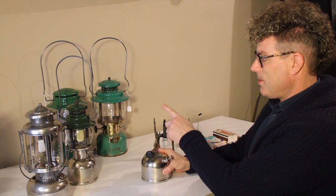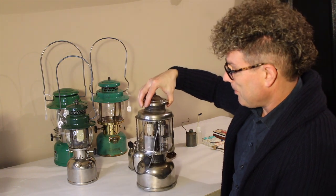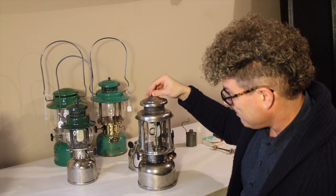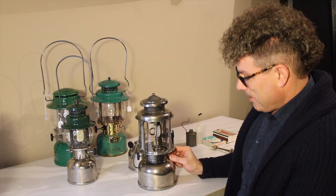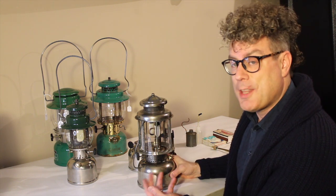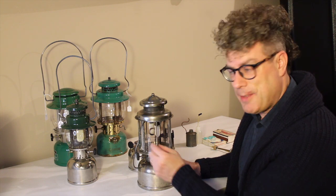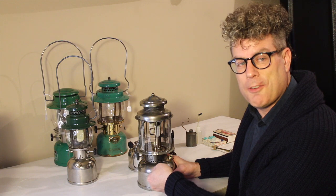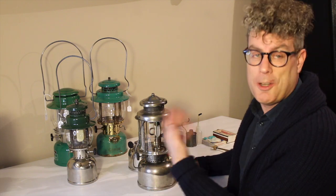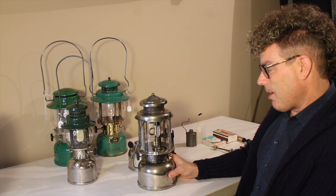On the quick light, these are gasoline — it only needs to get up to 98°C. On earlier models like the arc and arrow lanterns, the generators were fairly big, straight, and would flood if you just opened the valve — they required preheating. That was done with a little torch dipped in alcohol; you'd hold it under the generator for a bit, heat the generator, and then open the valve so the flame lit the mantles. Messing with that little torch in an alcohol bottle is kind of a pain, so Coleman came up around 1920 with the Q99 generator. You can see it's very narrow — easy to heat up — but it's got a loop in the middle. It's designed so that you take two matches, light them, and hold them under that loop. It takes 10, 12, maybe 15 seconds at most, and that's enough to preheat the generator.